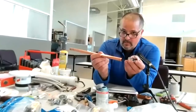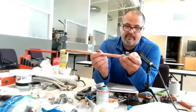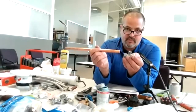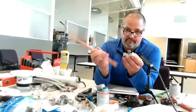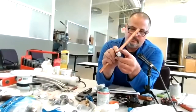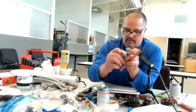What do you do when one of those toilet valves freezes up? To free it up, if it's frozen, shut the main off, then undo it and just get rid of it — start over, get a new valve in there. If it's not going to turn, the new ones turn a quarter turn just like that. The older style, they turn and turn and turn. But I put a lot of quarter turns in.